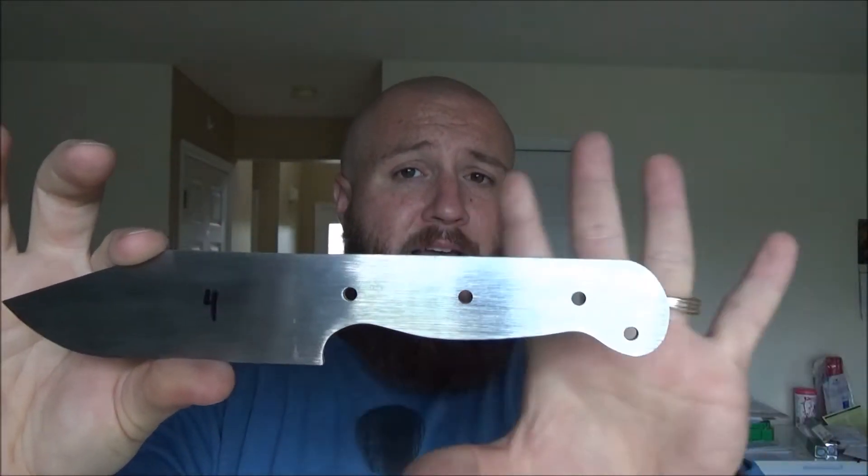So what's going to have to happen is I'm going to have to show you on this knife, which is not ready yet because it still needs to go to heat treat. In fact, I've got four of these blanks already profiled out and ready to go to heat treat, and I'm going to do a fifth one to knock that out and get it ready. But I really need to have more than five blade blanks for heat treat — I need at least 10 to make it worth the price of shipping and the heat treat.